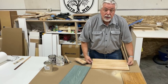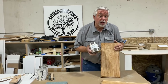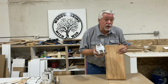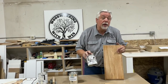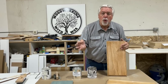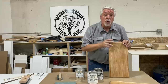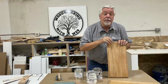We're going to finish up the other panels and head to the paint shop. For our color coat we're using a pigmented pre-cat lacquer mixed to a Sherwin-Williams color — Blue Chip — picked out at our Sherwin-Williams store. The glaze we're using is ML Campbell furniture glaze. I went to Sherwin-Williams, picked out the white I wanted and the black I wanted, and they mixed me white glaze and black glaze according to the color chip. That's how to pick your colors when having glazes and lacquers mixed — just take a color chip to your paint provider.